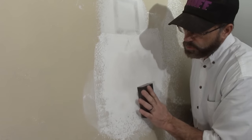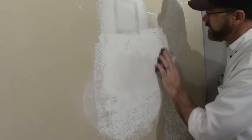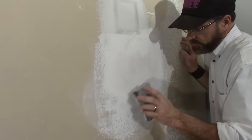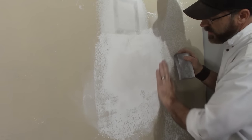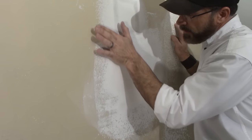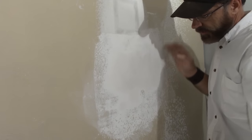Let's go ahead and sand this one and take out these imperfections. It doesn't have to be perfect because it's going to get texture, and that covers a lot. We're going to take like an 80 grit or 120 grit and just hit that. Remember there's texture here, so we're going to try to blend that into the texture so we won't see a ridge where you can obviously see there is a patch. Just sand all the lines out — the imperfections. It doesn't take much. Blend that in and that's really ready to go. Up here where we used caulking — it's good to go now. When you do that second coat, just hit the edge tight with your knife and it's already blended.